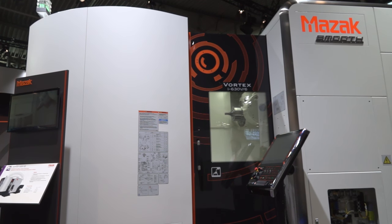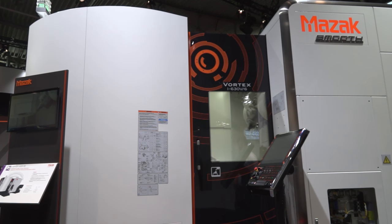You've mentioned titanium so presumably aerospace, but these appear to be mock-ups of automotive components — is that another applicable sector? Yes it is, and the versatility that a two-pallet changer brings gives extra productivity. The machine can also be linked into our very successful Palletech series, which provides unmanned running and can be linked into another range — for example, this 5-axis machine with a 630 mm pallet can go into a Palletech system alongside a horizontal machine with a similar-sized pallet.